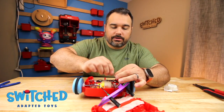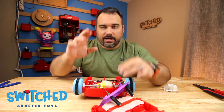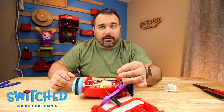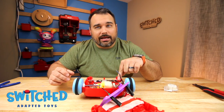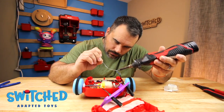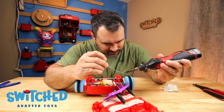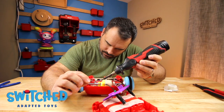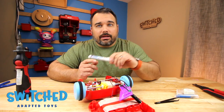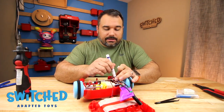One key thing here is you want to make sure your wires are nice and neat — twist them together and make sure there aren't any stray wires. What we're going to do first is get some solder on the wires, and that'll make it a lot easier when we're trying to get them onto the circuit board. One good thing to get is a flux pen.